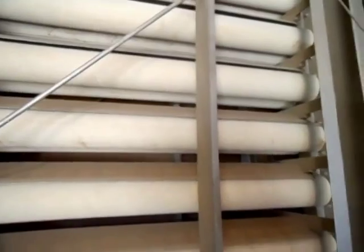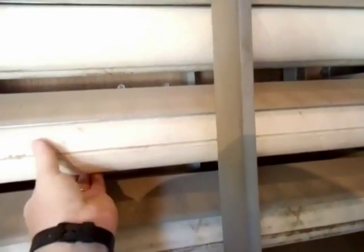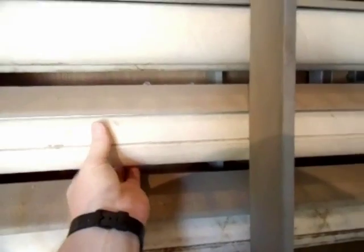Now these machines are pretty amazing machines. The rolls are on an angle, which is adjustable pitch. And they're also variable speed. But there's not much adjustment once you have them set from season to season. They're covered in velvet rolls. They turn opposing one another, and the seed goes down to crack.